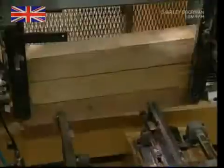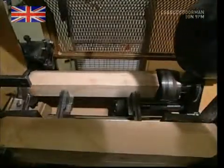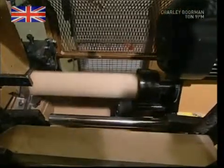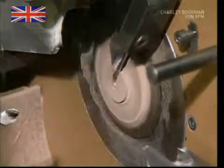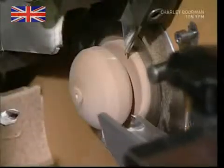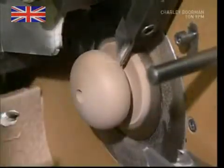As well as the bodies, the lids are also fashioned from the beech. This is the part that's twisted to crush the peppercorns over your pizza or fresh lasagna. A similar process is used to carve the lids from one long plank. As the wood is pushed forward, grinding arms move in and shape the lid before a drill cuts the hole for the screw and the final arm breaks it off before starting on the next lid.